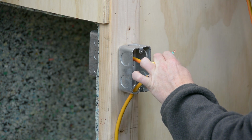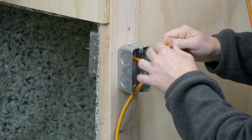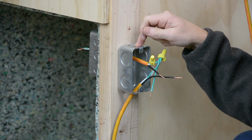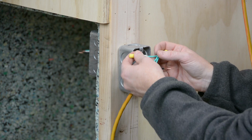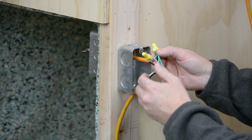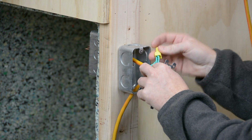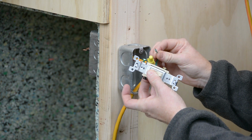Have to do a little bit of wiring before we put the vac into the cabinet. I chose to cut up an old extension cord to become the cable that feeds this whole apparatus. There's a box mounted on the outside here where the power comes in. The neutral, the white wire, just goes straight through to the inside. But the hot, the black wire, is going to get switched, and the ground goes through to the outlet, but I also needed a little pigtail so that I could ground the switch.